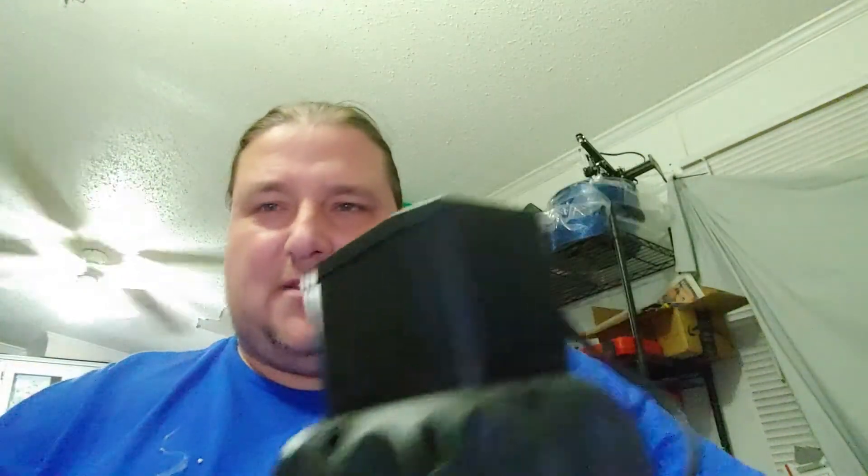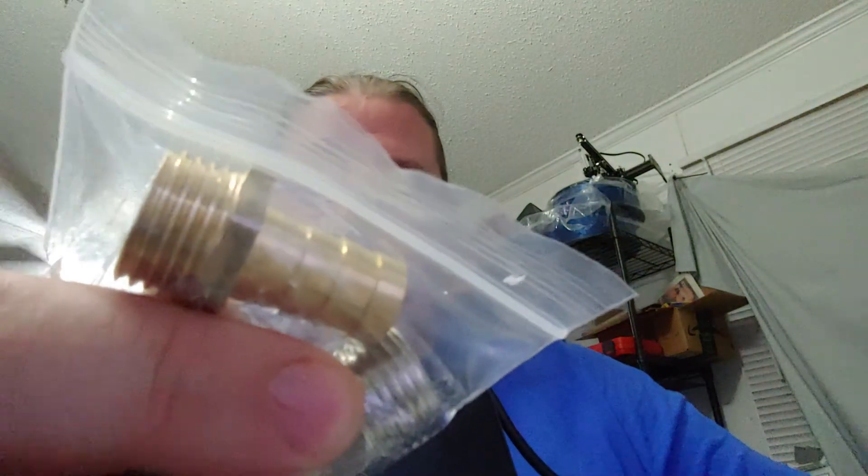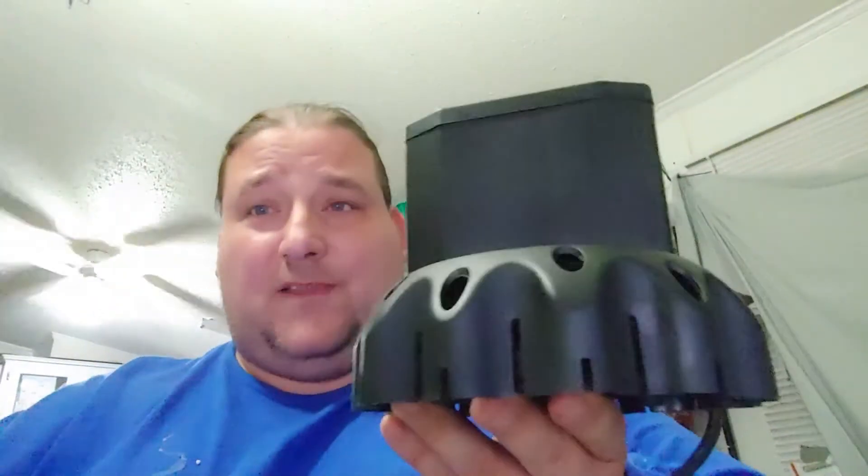Pretty neat — this thing is heavy duty, nice very long cord. It's supposed to be automatic: you plug it in and let it run. Obviously I'm not going to leave the tarps out, because I'm going to collect bugs and leaves and stuff like that. So when I know rain is coming, I'll unfold them, plop this bad boy in the middle, plug it in, and once the water level comes up to 1.6 inches the pump kicks on and fills up my barrel. Pretty darn neat — and legit brass fittings too. That brass barb right there is likely what you would use for this.